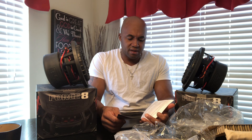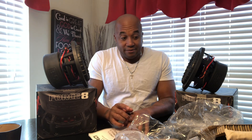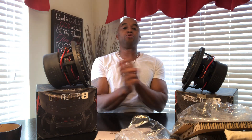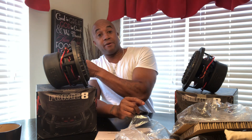The Fs on this is 54 Hz. Remember, the Fs doesn't necessarily dictate how low a subwoofer can play — watch the video I did on that, as it's really about where the driver resonates in free air. This subwoofer, with its larger basket, has a sensitivity rating of 82 dB — only 1 dB lower than the Kicker. Same thing with the Fierce 8: 82 dB. They're very efficient drivers utilizing two different approaches to achieve the same result: great bass.